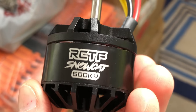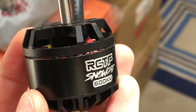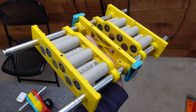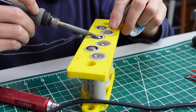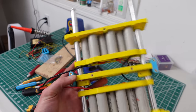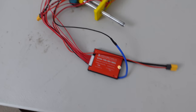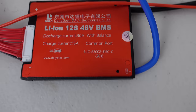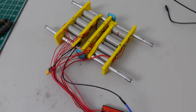For this build, I'm using 600kV motors, and I'll probably burn them out, so I would not recommend trying this yourself. I designed some new mid-axle rails that incorporate 2170 size lithium-ion cells right into the frame. I just soldered all the cells together to create a 12S pack. Now we need a way to keep the cells balanced, so for that I added a BMS. This also adds overcharge protection. To discharge the battery, I'm bypassing the BMS and just discharging straight from the cells.